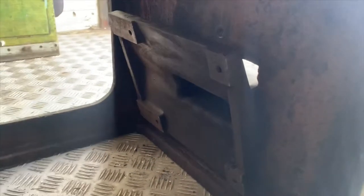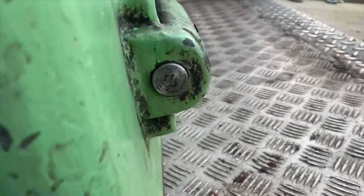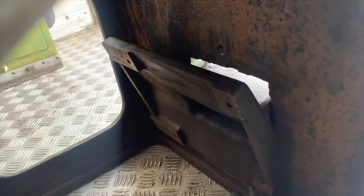Is the motor plate fitted back inside. This pivots on the steel pin mounting point there so that you can adjust the tension of the belts. So the weight of the motor is what does it, and then you lock it off with a couple of bolts which go through these holes to set your plate in the same position.